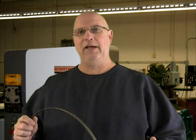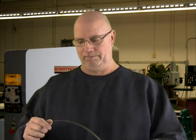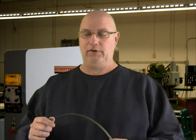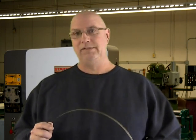Hi, today we're going to be talking about resistance welding of bandsaw blades. And there's really three reasons that justify the use of a bandsaw blade welder. The first, obviously, is when you break a blade and you want to re-weld it. The second reason has to do with internal cutting on the bandsaw, where you'd want to purposely cut your blade, pass it into a pre-drilled hole, and then re-weld your blade for internal cutting. And the third reason, well, is money.